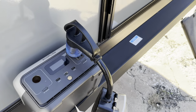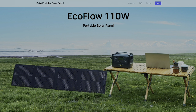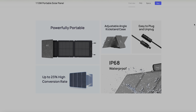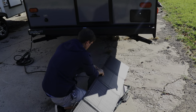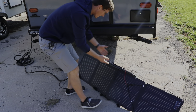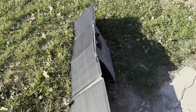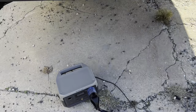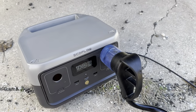To complement the River and keep it topped up as much as we can, we have EcoFlow portable 110 watt solar panels. Let's get that opened up and plug it in to the EcoFlow River 2. The carrying case allows it to sit at the perfect angle. We've got the solar panels positioned 90 degrees at the sun — no clouds out today. That is going to be charging up this unit at around 110 watts. You can see it's at 100% right now so it's not doing anything. We've got the 30 amp plug plugged into the River 2 and the solar panel charging the River 2.